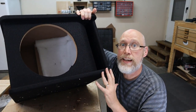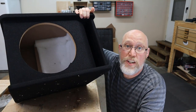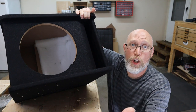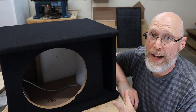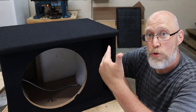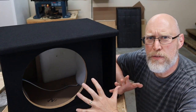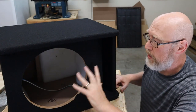That means it's got a decent-size port - it goes all the way to the back and then turns. The specs online said this is a two cubic foot box, and depending on the size of the port it's going to have a lower tuning frequency than the last box I tested, which is a good thing because that box was tuned way too high. One thing I'm not sure about: since the back wall is slanted and the port is straight up and down, I'm not sure how that's going to impact the port tuning. The port on the inside of the box has a slightly larger opening than on the outside.